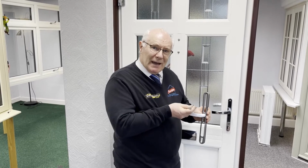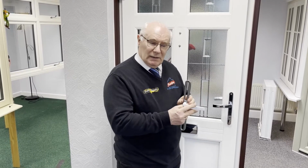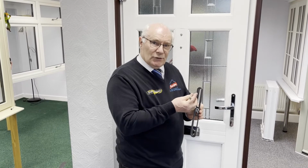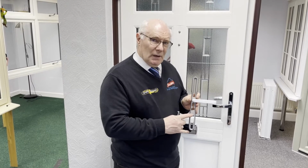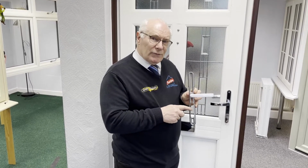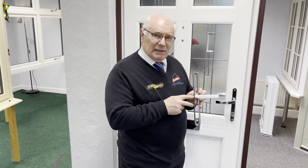Once this is secured to the door, with the bolt going through from the back to the front, the other frame at the other side is exactly the same, but with the handle in the reverse position. So now we've got a pair with the bolt fitted through it, and the only thing that you've got to do as you order this handle is measure the PZ centre, and that's the centre from the square where the handle goes through down to the centre of the circle where you insert the key. Once you've determined that, you order the correct sized cover plate.